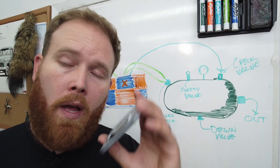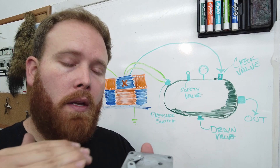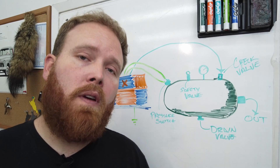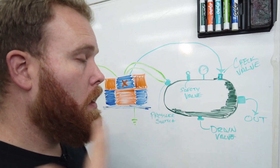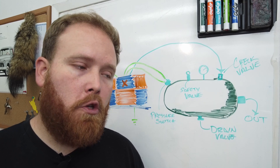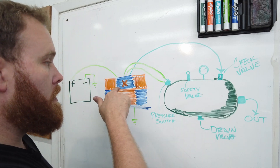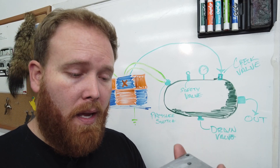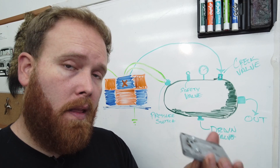Let's go to the whiteboard and I'll show you guys the diagram of the pieces and parts and how they all interact. This is a cylinder head from the Maxi Track compressor. It has some reed-style check valves pushing against O-rings, so there's no need for an unloader valve. We found we don't need that because of this style of reed valve on these heads.